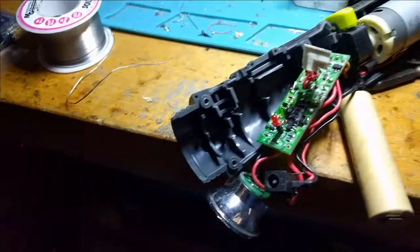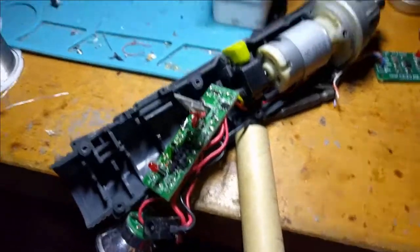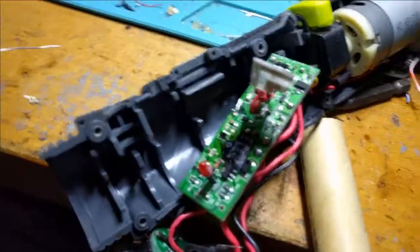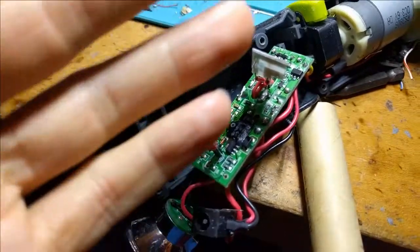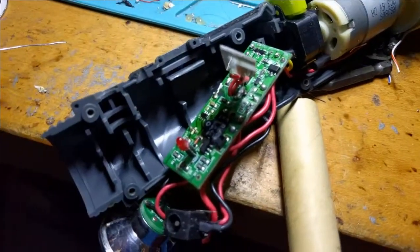This is a 12 volt charger, and I think the original is like a 14 volt, but I think the polarity must be reversed. So word to the wise, folks — this is why you include polarity protection in your circuits. This could have caused a fire.